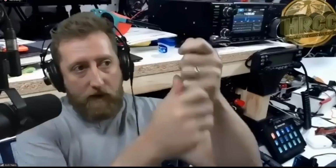It's a great antenna. So does that have to be set up in an inverted V sort of formation? Yes, and it's designed specifically for that. The wire winders are all attached to the elements, so you just unwind the whole thing. You lay the pole down, you attach the center connector, you stretch the links out fully, and then you come back in 1 meter, stake it, and then just lift the whole thing up, and that's it.